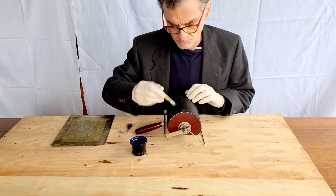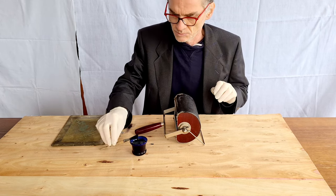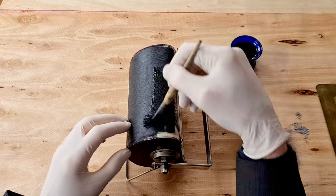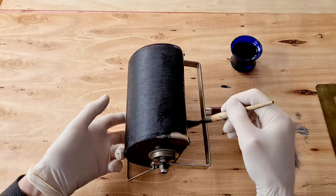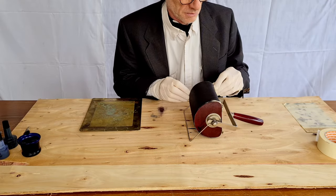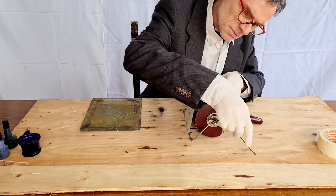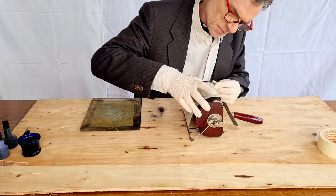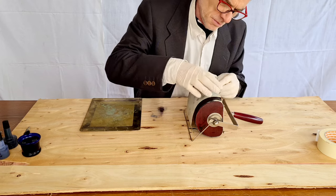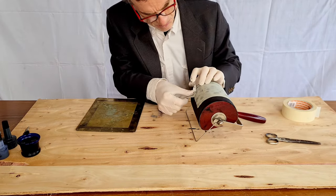Now I have to ink the roller of the mimeograph. I use the original brush to ink the printing surface of the roller. After inking the first time, several minutes must pass to let it soak in. Then the roller must be inked again with the brush and let soak in again. You must continue to apply the ink with the brush until the under-pad becomes completely soaked. I place the stencil face inwards on the ink pad, fix one end with the clip, and smooth the stencil over the pad carefully to ensure complete and even contact. The stencil is too short, so I fasten the other side with scotch tape.